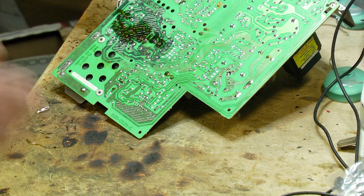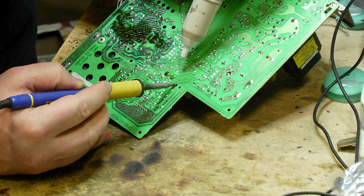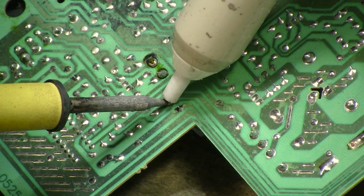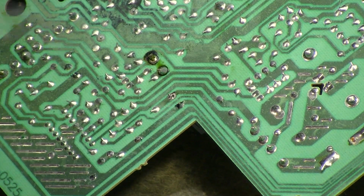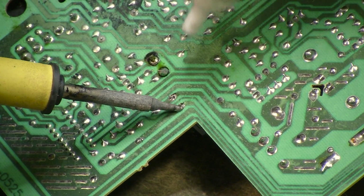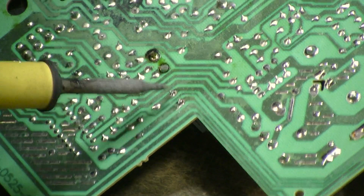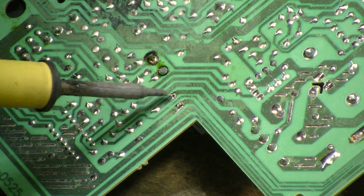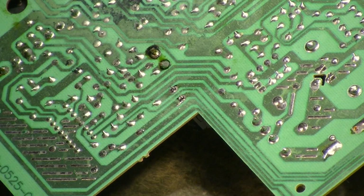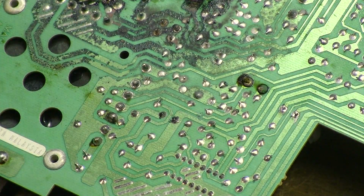So, once again, applying some solder here so that the solder gets all molten. Bring my sucker up to it, press the button, and that just sucks all the solder away. Let's do it with this one. Up there, put this on top, sucks the solder away. Actually, I think this one is glued, so I'll probably have to pry it from the other side. And then the last one is a little guy down here, and I'll do the same.